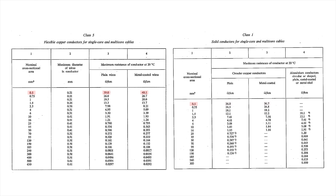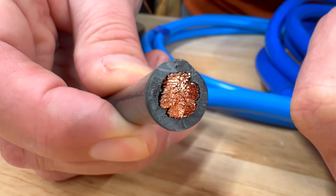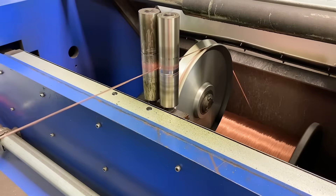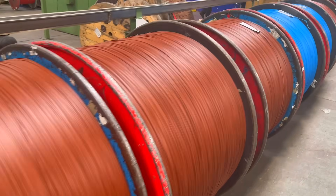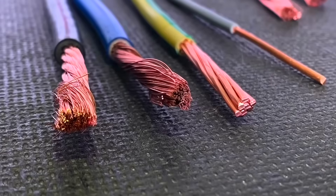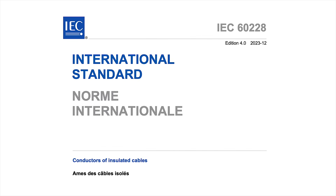Interestingly, this same process results in a slight increase in the resistance of a class 5 conductor compared to a class 1 solid conductor. Another key factor is that cable cross-sections such as 2.5mm², 6mm², or 10mm² are standardised, but the exact diameter of the conductor isn't. Standards focus solely on the diameter of individual strands and conductivity of the finished conductor, meaning a conductor manufactured with higher purity copper can achieve the required performance with a smaller physical diameter. Understanding these nuances helps explain why ferrule sizing may sometimes seem inconsistent.